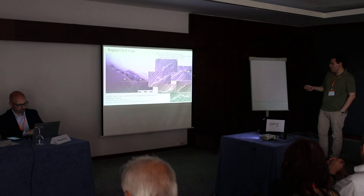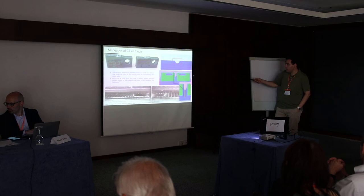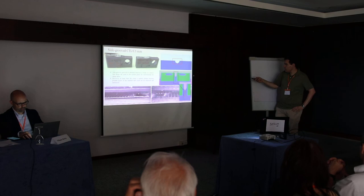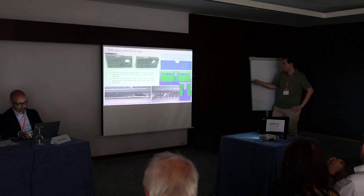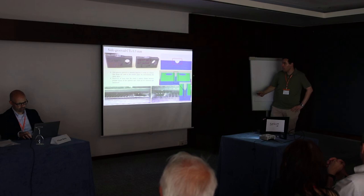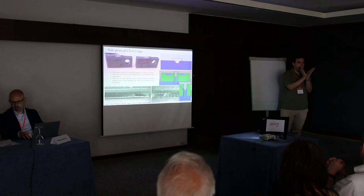Yes, just to mention again, this is how the side groove looks in the slicer software. So this is in the CAD model, and the side groove is like this half circle. By creating the model in the slicer software, it doesn't look like a circle. It has to fill in these layers. The problem is the first layers close to this surface. The crack from here started to develop a little underneath this layer, and the improvement maybe is to change the geometry of the side grooves, maybe V-type, or just to machine them like that.